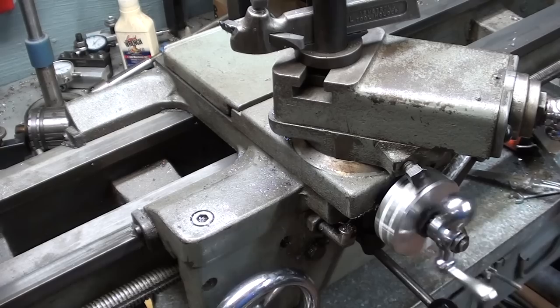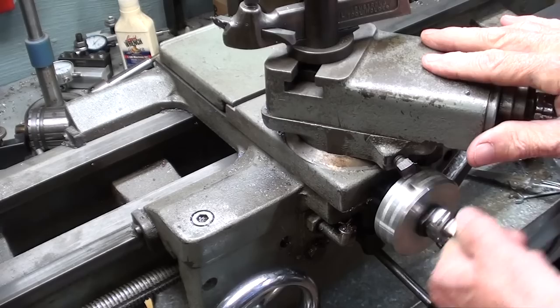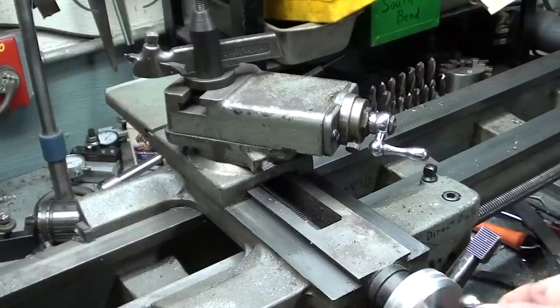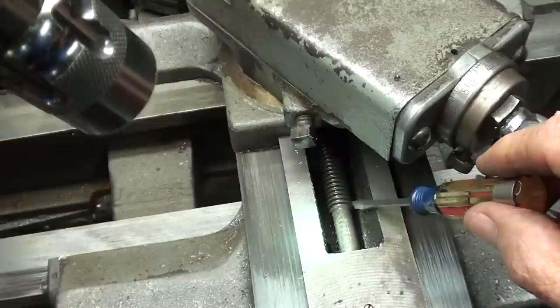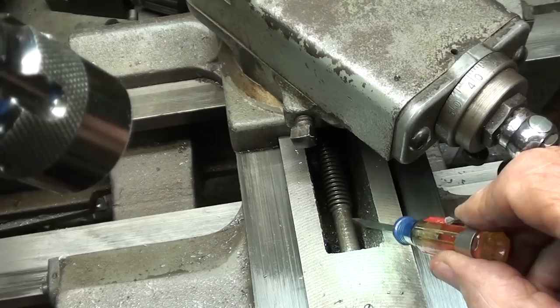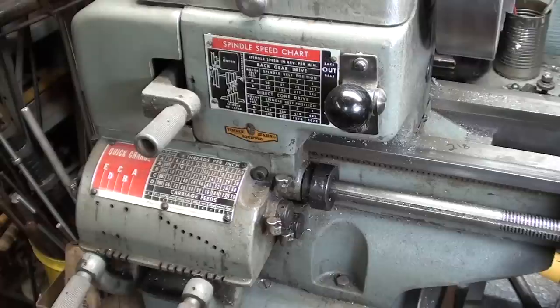We're at the Atlas Craftsman 12-inch lathe. Notice when I feed the cross feed out, at some point it becomes disconnected from the screw — that would greatly protect you when feeding under power. You are never going to be feeding this far out, but if you do, it also becomes disconnected. Look at the way the cross feed screw is designed: there is an unthreaded portion right here, and that's what happens when the nut comes off the screw — it enters this unthreaded portion, and that protects you.